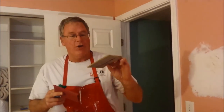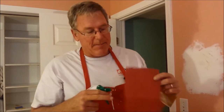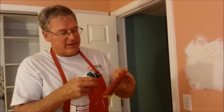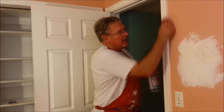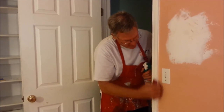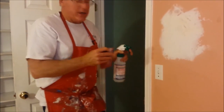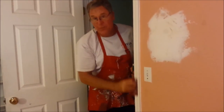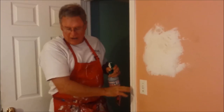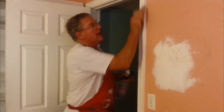I showed you this sanding sponge, but there's also sandpaper made by 3M. If you notice that it's purple, that means it can handle getting wet — really cool stuff. I use this oftentimes to do my sanding. I'll wet the surface, and this can be a little bit more aggressive. I'm using a 100 grit here, but even though 100 grit would normally be a little aggressive dry sanding, when you're wet sanding you can use a more aggressive grit and still get a very smooth surface. And if it feels a little too rough for you, go to a finer grit — here I've got the 180.